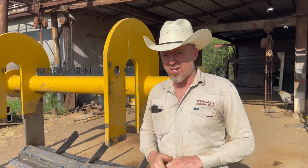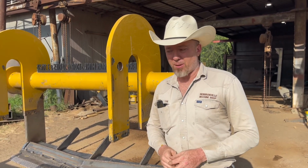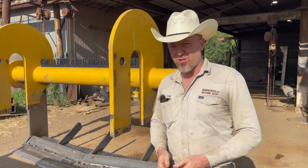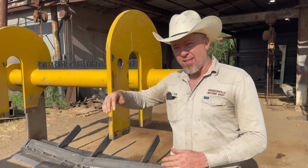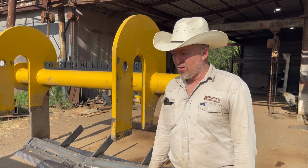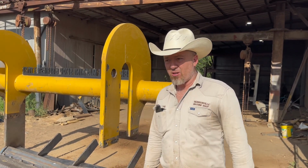Just keep in mind what I said about the D6T and down as far as their ripper bars and their single piston, which is really going to put a damper on your plowing. So the more pistons you have to help you go down, the better you are, especially in hard ground. And the height of your ripper bar has so much to do with doing a good job plowing. So, like I said, just keep that in mind, and if y'all ever need anything, y'all know where to reach us.